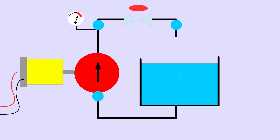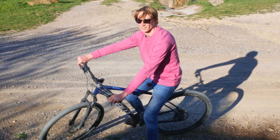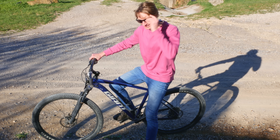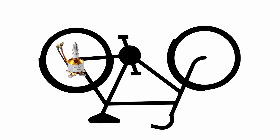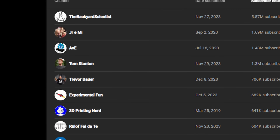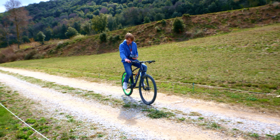At first I wanted to connect the motor to a pump and regulate the load by adjusting the pressure, but finding a suitable pump within my budget turned out to be a challenge. Where can I find a device intended to reduce the rotational speed of a thing in a controllable manner? Since all the sensors are mounted on the static side of the dyno, it really doesn't matter how we add load. We could just flip the bike upside down, attach the motor to the wheel, and use the bike's brakes to slowly increase the load on the motor until it stalls. And since I know one subscriber would be disappointed if the dyno didn't also work as an e-bike, I designed the system to do both.